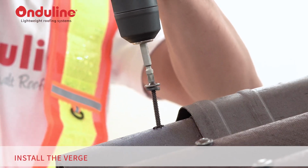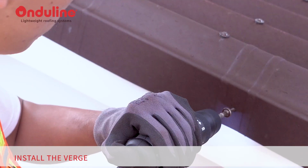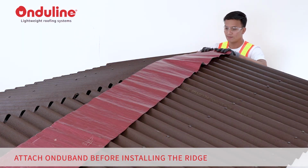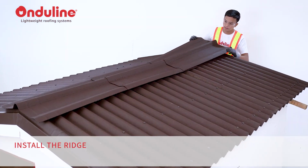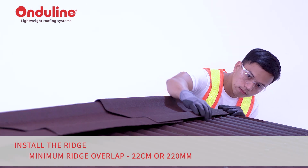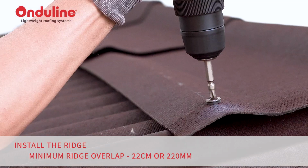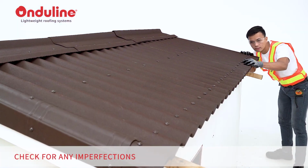Install the verge. Attach Onduband before installing the ridge. Install the ridge. Minimum ridge overlap, 22 centimeters or 220 millimeters. Check for any imperfections.